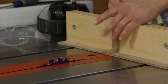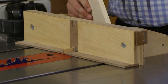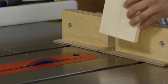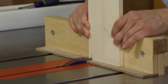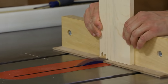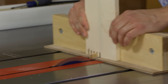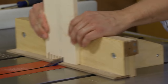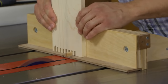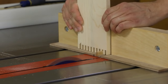On this jig you can flip around the backer strip for a fresh support surface so you won't get chip-out on the back edge. For the first step, put the workpiece on the jig ledge right up against the key and cut a notch. After that notch is formed, we start a step-over dance: step the notch onto the key, make a cut, step it over, make a cut. Try to concentrate on keeping the piece down and straight — subtle side pressure over all those cuts can add up and result in joints that don't go together properly.